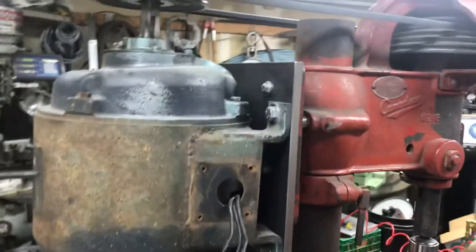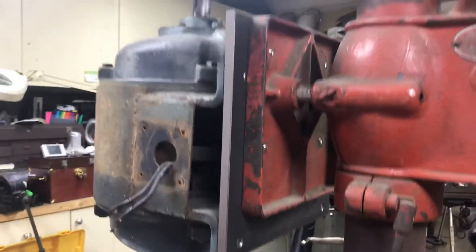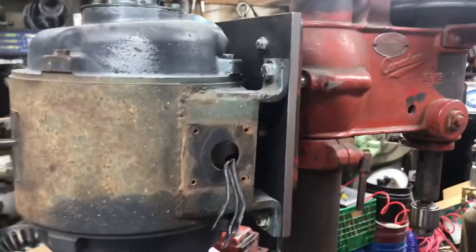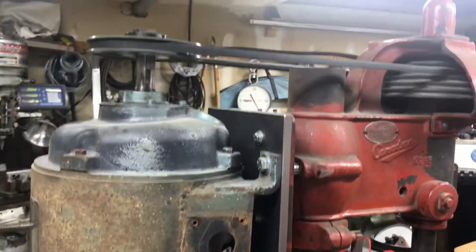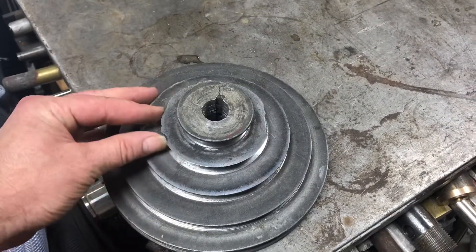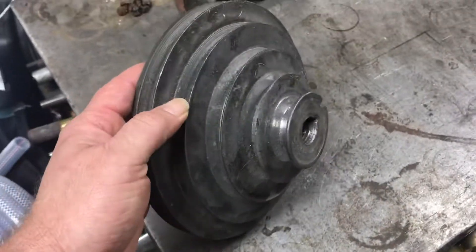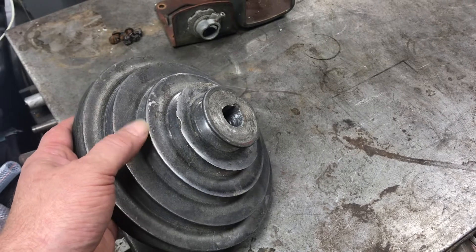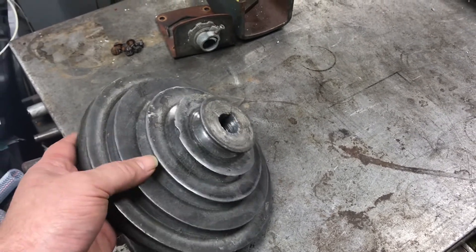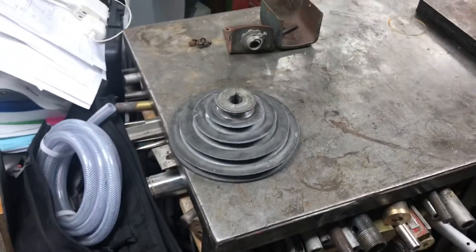I had to mount it — I got myself a half-inch plate because the back motor plate is quite a bit smaller, so I needed a bigger plate to mount that motor frame. The original pulley was so badly damaged I had to pull it off — it's chipped, all wallowed out, and some edges come down to razor blades where they're kind of shearing off the belt, fraying it up pretty quick. I put a new belt on and you can see little pieces of rubber flying around.